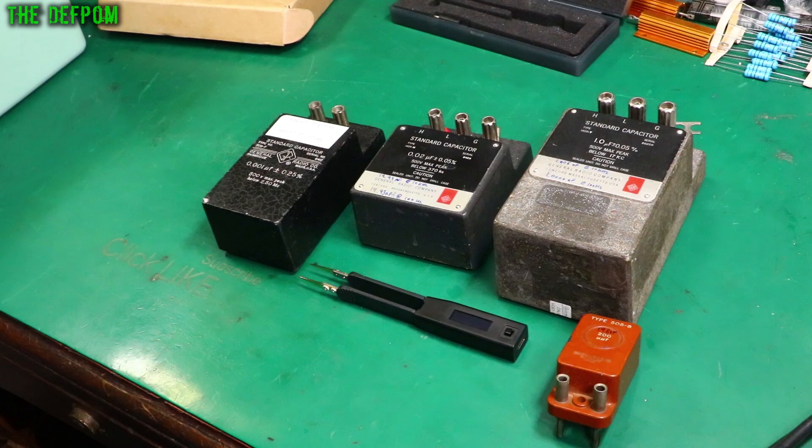Capacitance spec shows half a picofarad up to 5,000 microfarad, but I actually measured a 10,000 microfarad cap with this thing, so it's actually exceeding the spec. Inductance can do half a microhenry up to 999 millihenries. I did some basic inductance checks previously in the last video, but I don't have standard inductors so I can't give a true accuracy indication — you'll have to take my word that it seems to work.